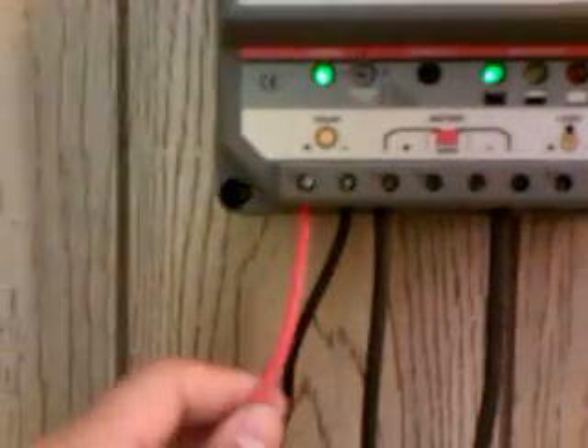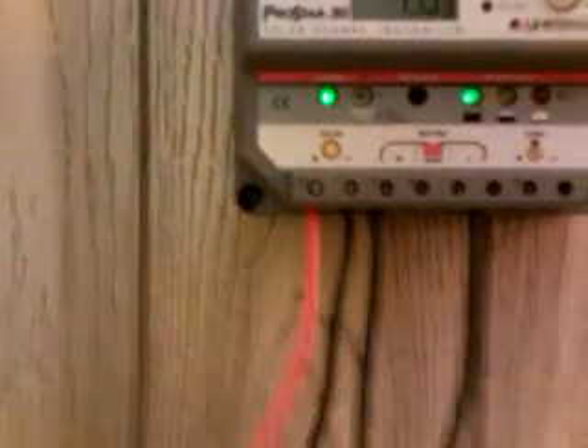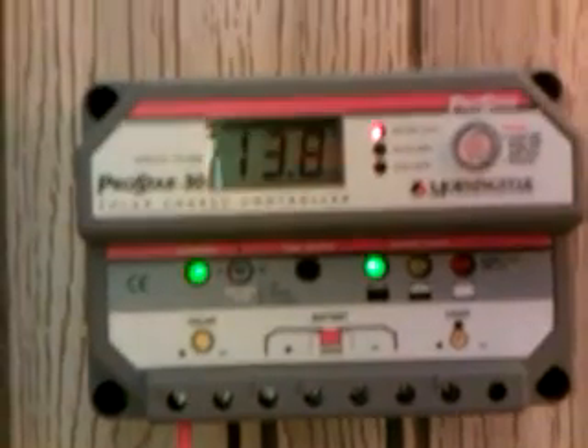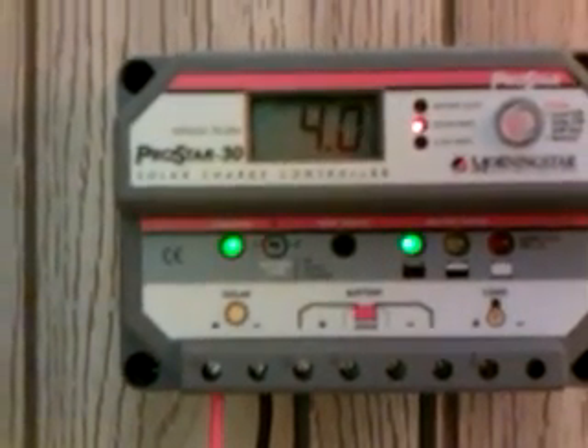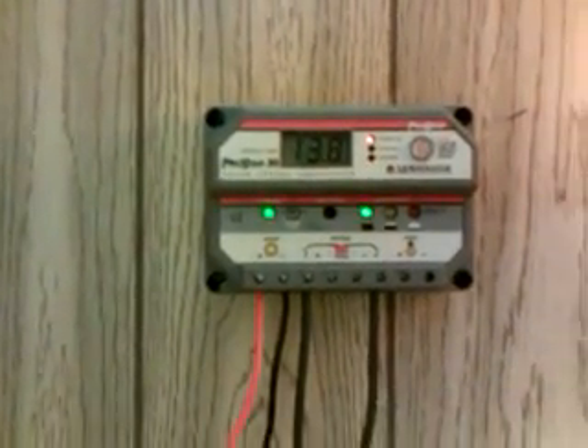This is where I have my two connections here for my battery, and these are the cables for my positive and negative for my solar panels. I have an 85 watt multi-crystalline solar panel, and as you can see I'm already putting about 4.0 solar amps, which is not bad. I should be at 4.8 — that's what they max out at.